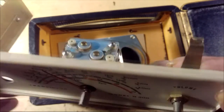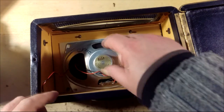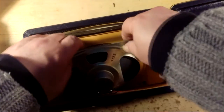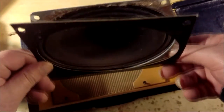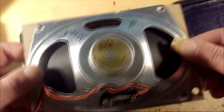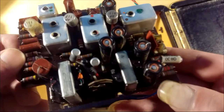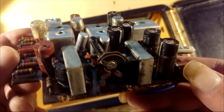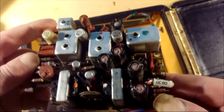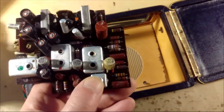I've saved the on-off potentiometer as well, which I hope to use as an on-off switch. It's going to be a Bluetooth radio, so no tuning needed, but it would be nice if the knobs still looked as they should. So I'm going to put it all back together looking as it should, and I've left those two potentiometers on there. This is the original single speaker inside — a nice little speaker — but I'm going to put a stereo board in there and fit some 3¼-inch round speakers. This board reminds me of ones I built at college where we filled out the circuit on one side with a pen, then dropped it in an acid bath to burn away the copper.